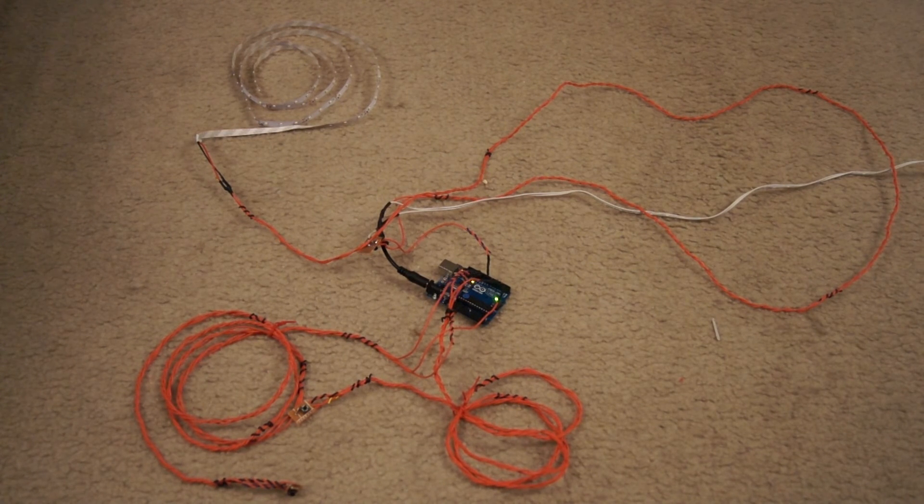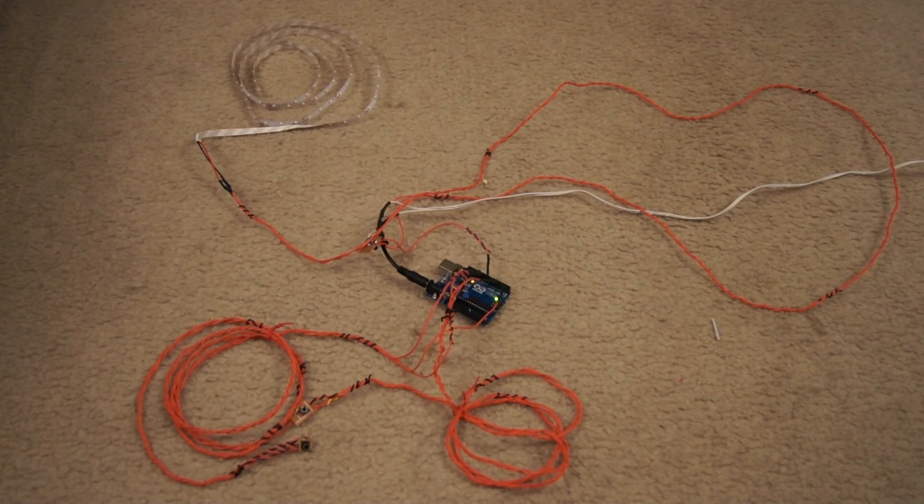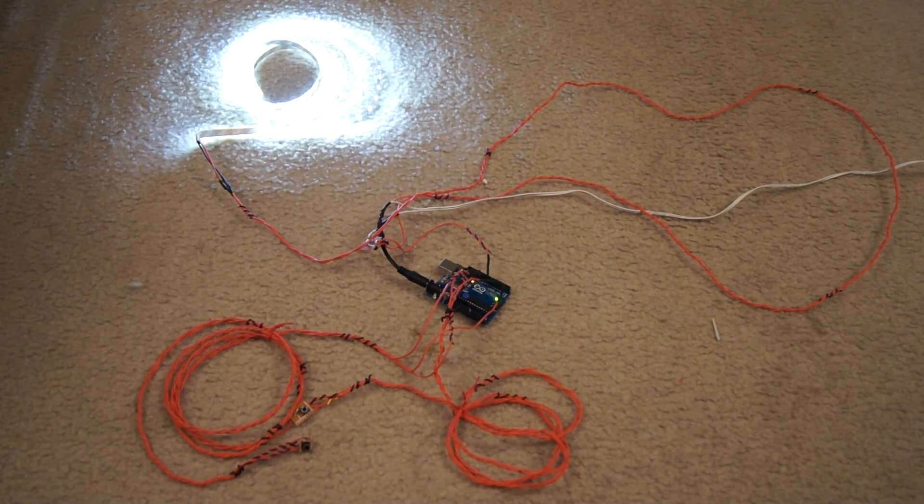What is in front of the camera right now is an Arduino-based nightlight. The string of lights in the top left of the screen is going to be double-sided taped to the ceiling — or the top of the wall right before it hits the ceiling. It's going to be pointing towards the other end of my room. There are two switches, one for either side of the bed. Hitting one starts a two-second timer, then they come on at full brightness, and over the course of 15 minutes they will dim down until they turn off. Every minute it'll fade into the next value and stay there for a minute, continuing down the line until it's finally off. Here's a quick time-lapse and then I will get into how it works.